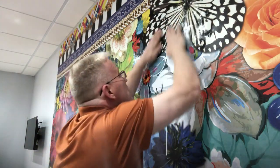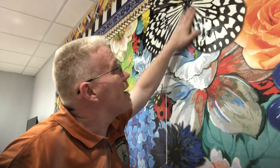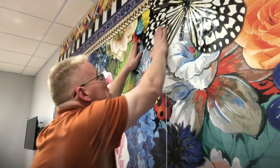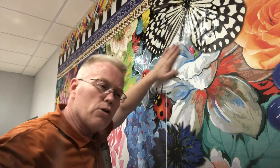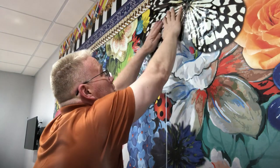I'm feeling the glue — it's gotten into the area pretty well. What you're really doing here is gluing down a very dusty surface, because this was fresh plaster or fresh joint compound and they sanded it. My suspicion is that they didn't sweep the wall off and get the dust off. So what we're really doing is gluing the dust — which is fine. You can simply make the dust solid by gluing it to the back of the paper and to the wall. The glue will hold it all together. Not ideal, but this is the way we have to operate now.